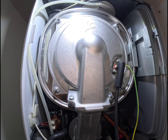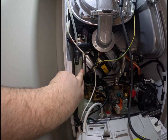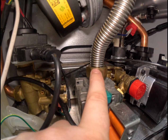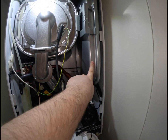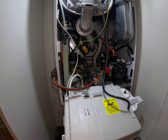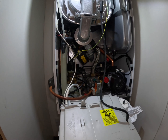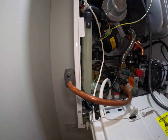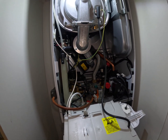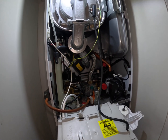Got everything back together — tightened up our nuts, spark electrodes back in, earth's back in, cleaned out our condense trap. We're just going to turn it on and spray up this joint here to see if it's leaking, because that won't pick up on the tightness test. Then I'll quickly drain down the boiler and check the expansion vessel is at one bar. I won't show you the readings for legal reasons — I don't want to encourage people to do gas work. This is connected to my phone via Bluetooth so I can see the readings. It's got a zero governor on it which effectively means it's just sucking through rather than using gas pressure, so you can't do burning pressure. I'll do a flue analyser on it but again won't show the readings.